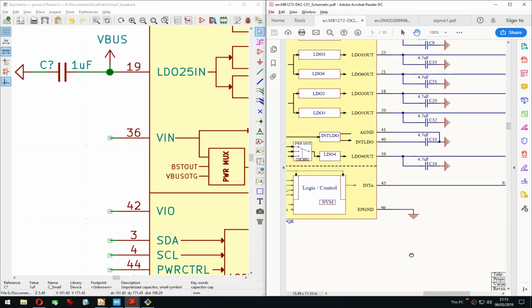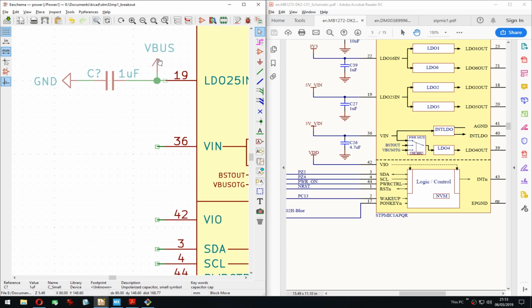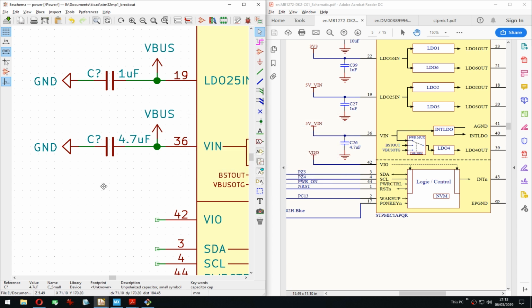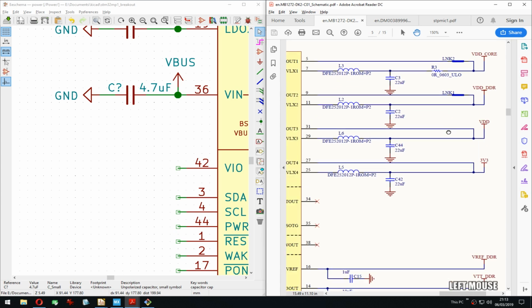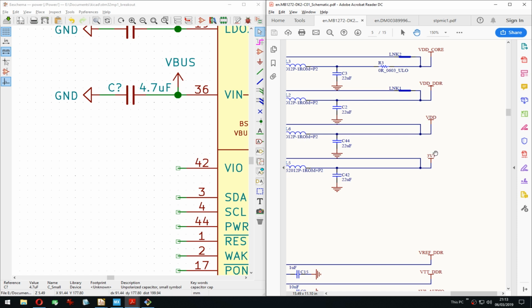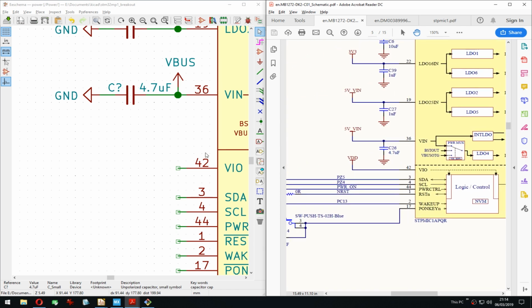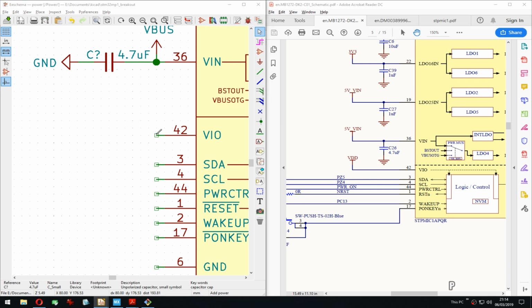VN for the USB, isn't it? Yeah. So there we go. And VDD, which comes from here somewhere. Yep, that's also 3 volts, or at least, isn't it? I would assume so. So why have the two separate names? I mean, I know why. Partially, I know why, because it's two different sources of that voltage, so you need a way to differentiate between them.